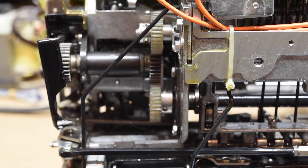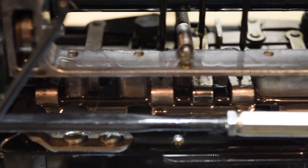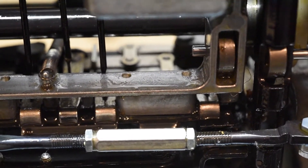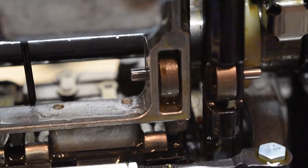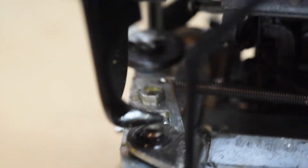Now that you have the machine up, it's the best time to actually start cleaning out some of the old grease and add some new grease. Definitely look at your wiffle tree right here — all those tabs, you'll find there's quite a bit of grease on them and I would clean them out. If you're having a problem where the machine won't type properly, types multiple characters, or just keeps typing on its own — you can see the actual rollers here. Those are what engage the wiffle tree and engage the tilt and rotate tape. This whole thing actually moves back and forth as it gets hit. And as you can see, if I move it that tape is moving back and forth. This whole mechanism right here — as you're typing this whole thing rotates and it was really gunked up with oil. I would definitely re-oil every single one of those.